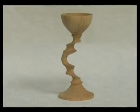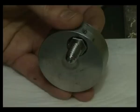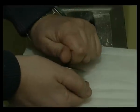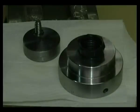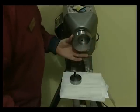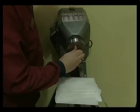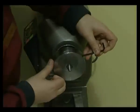The first project we are going to make is an offset stem goblet. For this project we are going to use the screw chuck attachment, which is fitted into the eccentric boss and held in place by the machine screw and washer. Screw the main body of the chuck onto the lathe and ensure it is tight by using the wrench. Place the eccentric boss into the main body and rotate it so that zero is visible in the sight window — the wood will run concentrically at this position. Retighten the eccentric boss screws.